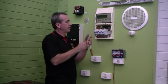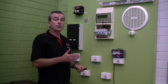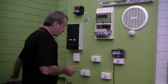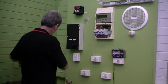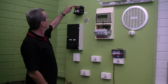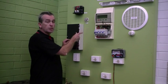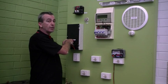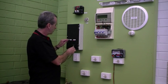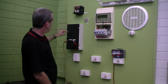I've now removed that one connection between earth and neutral. I've got to make sure that both the active and neutral conductors are continuous right throughout the whole installation. This is a brand new installation, which means the supply is not connected to the consumer's mains. We've wired the consumer's main active down to the meter position, and I've put a bridging lead to join those two cables together so that the main active is now continuous through the meter position.